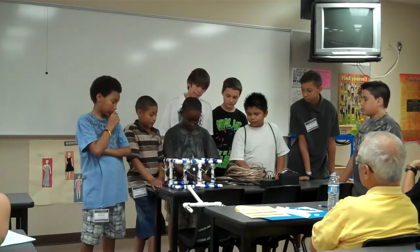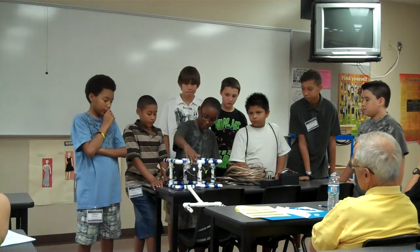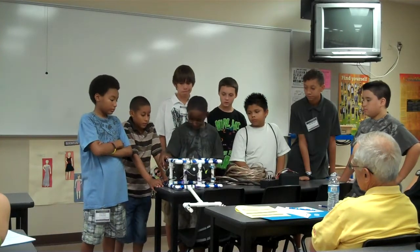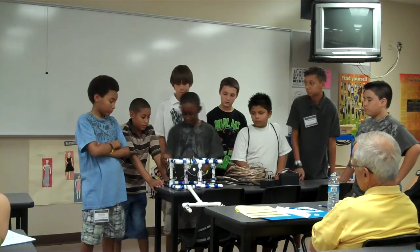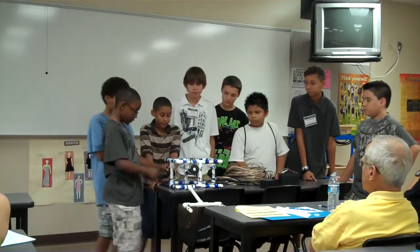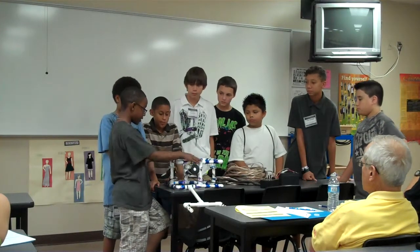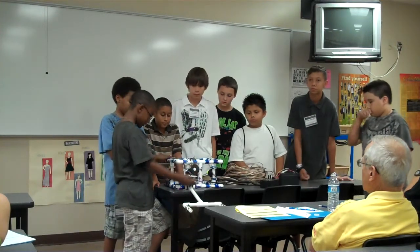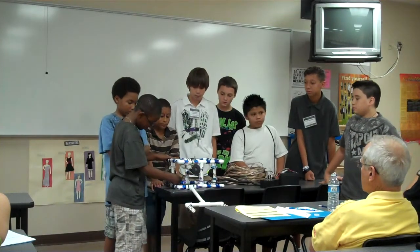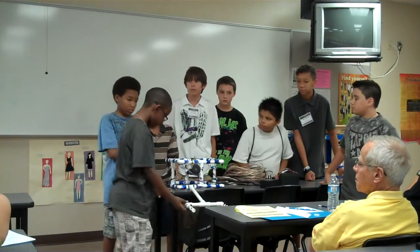We use zip ties to tie the camera and the light, those are these two, an LED light and a color camera, to our remote operated vehicle. Along with zip ties, we used epoxy glue, which you can't see because it's clear. It also helped put these in their place so they won't come out. And we used some plastic, so it's watertight. Water can't get in.